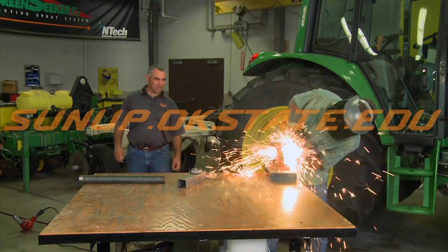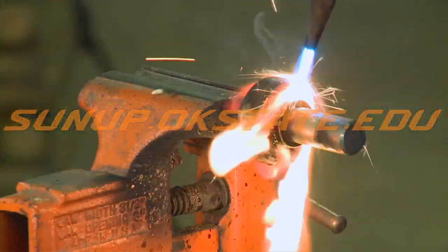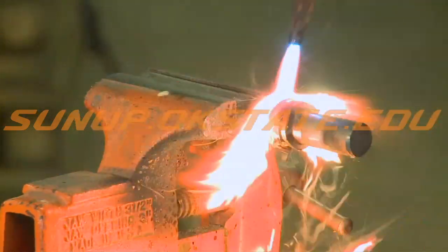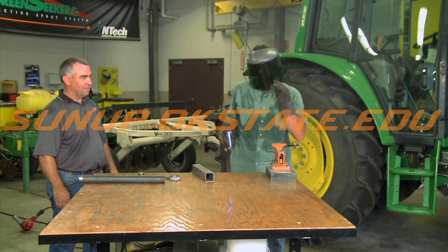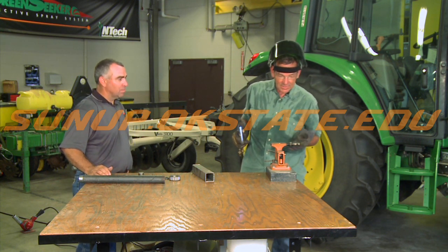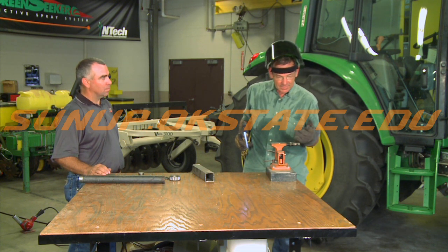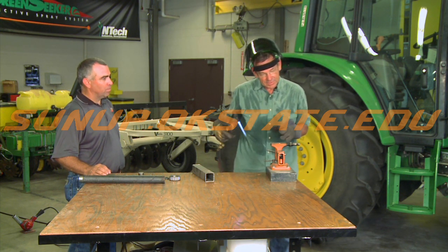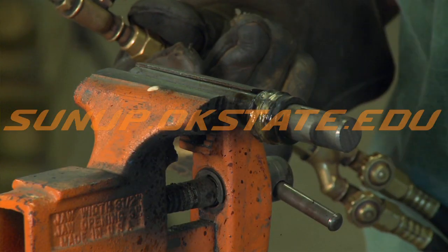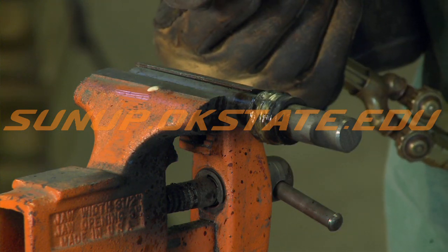You can see the grease is burning out of that. Now we've got the outer race off, we've got the cage off, and now we're going to cut that inner race off. I'm going to do that by angling the torch so as not to bite into that shaft as I'm making the cut. Let's see if I can do this without turning up the shaft.